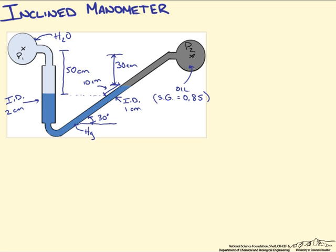You can imagine that if the right side of that incline tube was cut open and we started dragging that tube downwards, all the fluid on the left side would eventually flow out. So you would have to start tilting that tube up to prevent it from flowing, reaching some kind of equilibrium point. The further you drag it down the longer the tube you need. This means that with slight changes in pressure you can get very significant readings along that inclined plane.